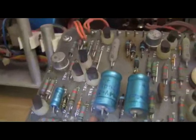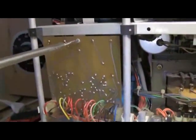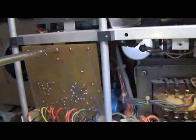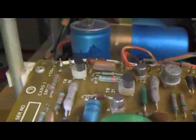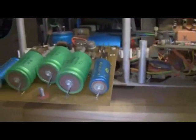Let's look at the next board. Again, these diodes here look to have been replaced — evidence of burn on the board itself, and the diodes all sit up proud rather than flush against the board. We'll assume that's a previous repair. The rest looks reasonable enough. Again, lots of electrolytics, so they're all candidates for replacement at some point.